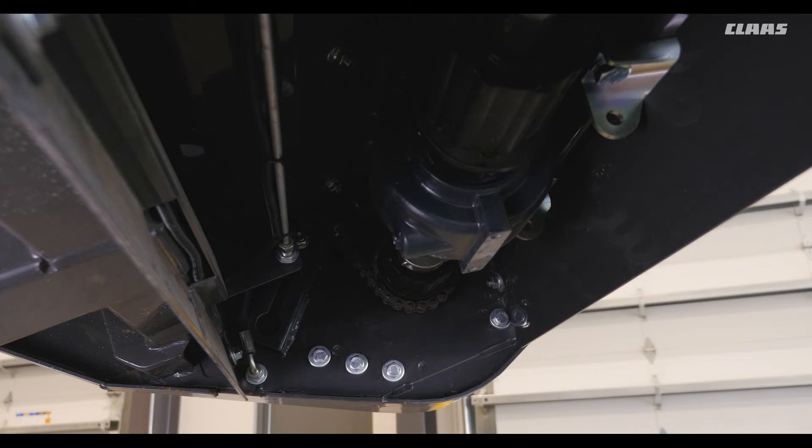When greasing the slip clutches for each individual row unit, please also grease the slip clutch for the auger drives located at each end of the head. While greasing these components, also grease the PTO shaft grease zerks. Reference the operator's manual for grease specification.